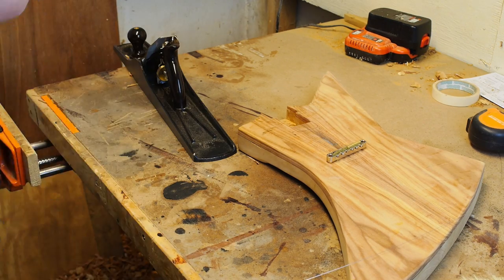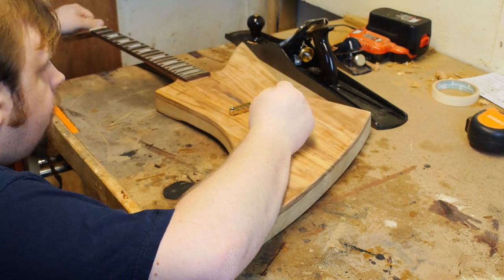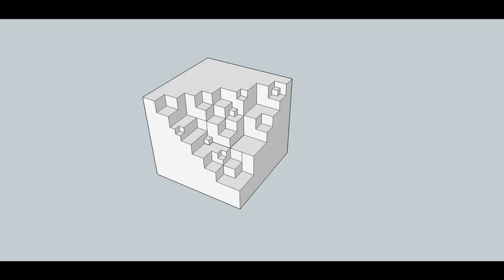I hit a point where I really didn't feel comfortable going any deeper, so I had to clean the neck down until it's set at a good level. The angle was still too steep, so I had to keep adjusting the pocket until I got it right, but I ran out of memory card before that. At this point the neck fits very tightly, which is absolutely astounding to me. I still want to wood fill the pocket since it's not exactly pretty and there's a lot of gaps. Then I'll finalize the location of the bridge, the tailpiece, the controls, and move on to the pickup routing. Cheers.